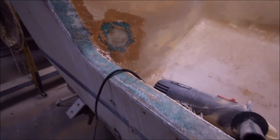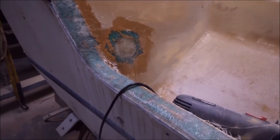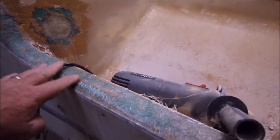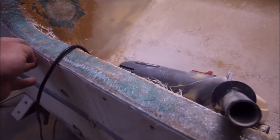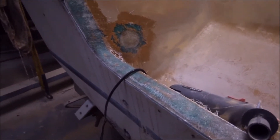The big one here is the transom. From the outside that just had the old flange meeting the transom down there. I've actually glassed all that together — filled and glassed the whole flange. But I'm not still really happy with it. There's plenty of fiberglass meeting fiberglass, so it's very strong. But I'm not overly happy with the amount of fiberglass lapping around this edge. So I'm actually going to grind right down around this edge now, expose all the fiberglass, and then glass a rim all the way around this so the whole transom will be one big solid piece both inside and out — exceptionally strong.